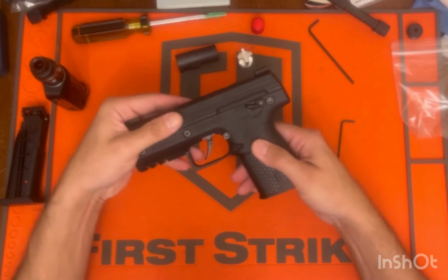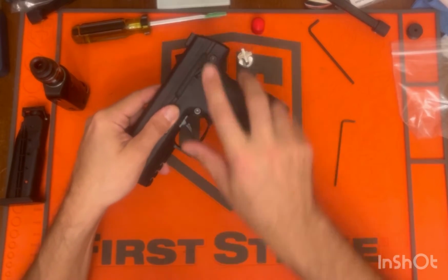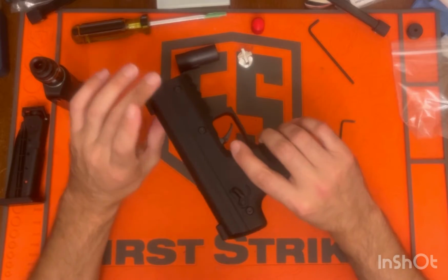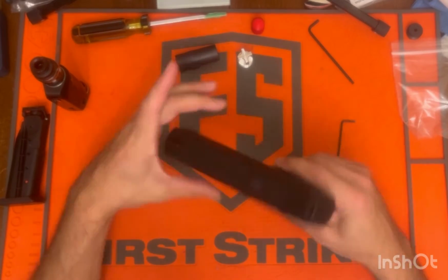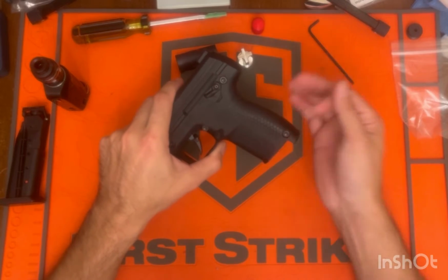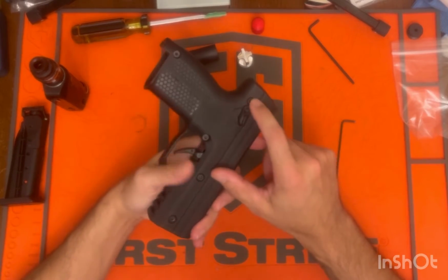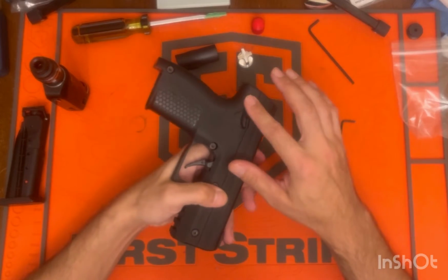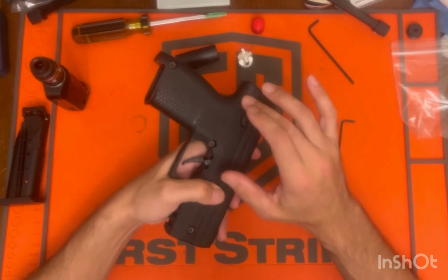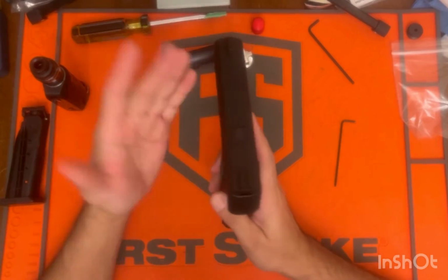And you can see these last 3 here, 1, 2, 3, are nutted on the back. It is not 2 separate screws like these 2 here are. So be aware of that when you're loosening it off. 1.5 turns or so, loosen these, but do not remove them. You also have to remove this top slide, I guess.